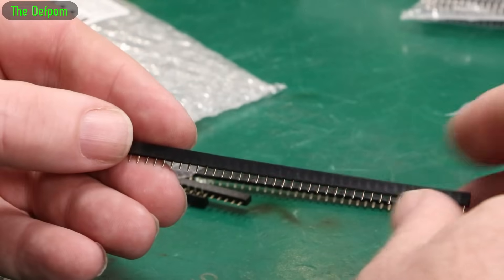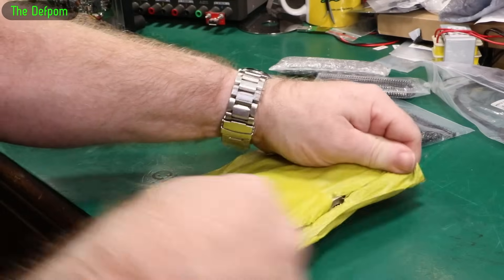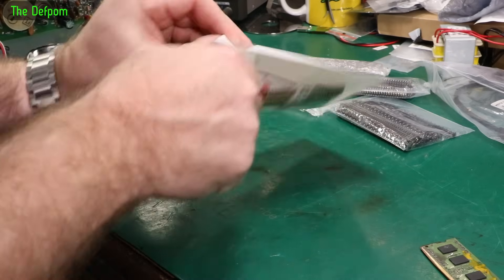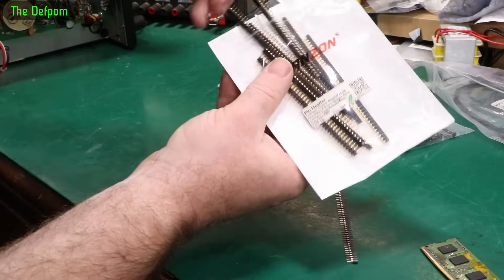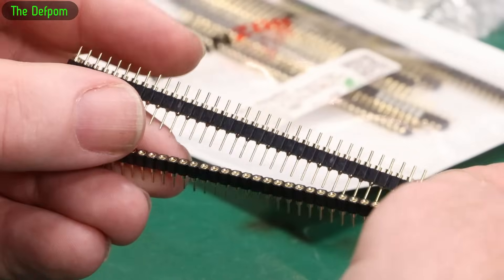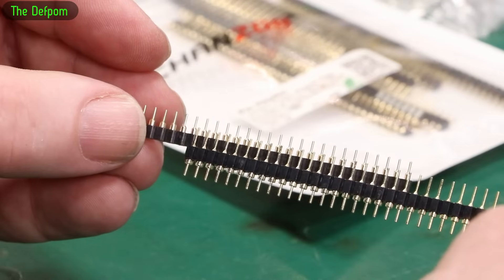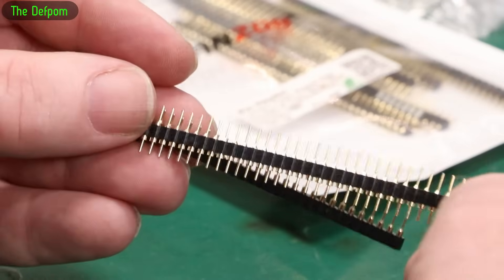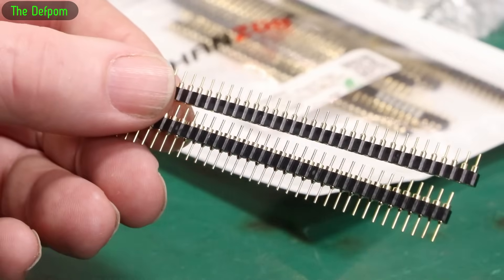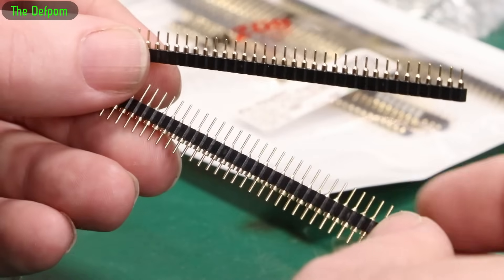Because they may need to fit into a smaller space than normal, I was thinking about using low profile headers instead of the standard high profile ones. These are round pin types — single line male and female. Again potentially for the project, and because they're quite low profile it gives you options for doing header systems. These are round pin ones which can be better sometimes than square ones — like if you're trying to put these inside a PCB. Sometimes the square ones don't fit the holes very well, whereas the round ones will fit better. So that's why I've got these.